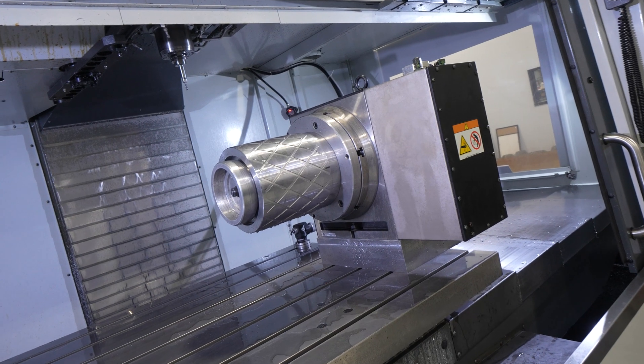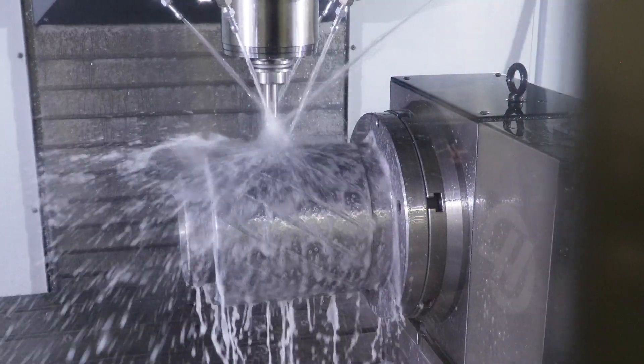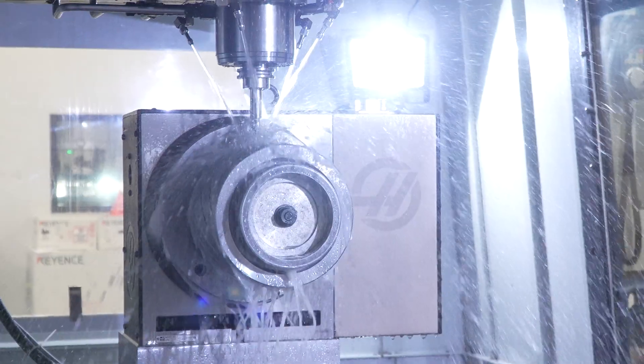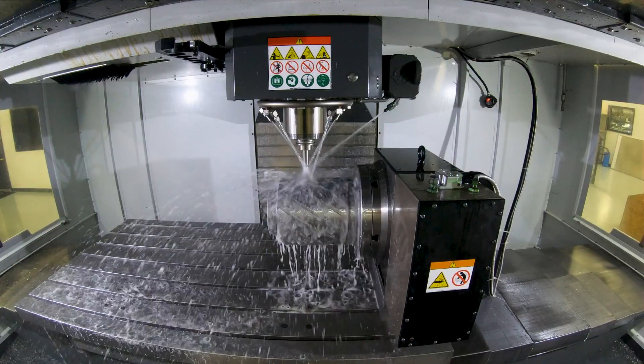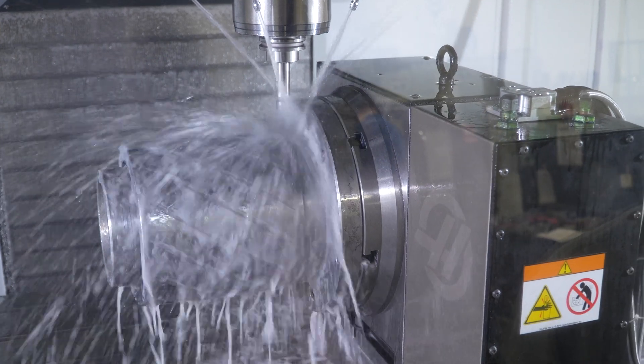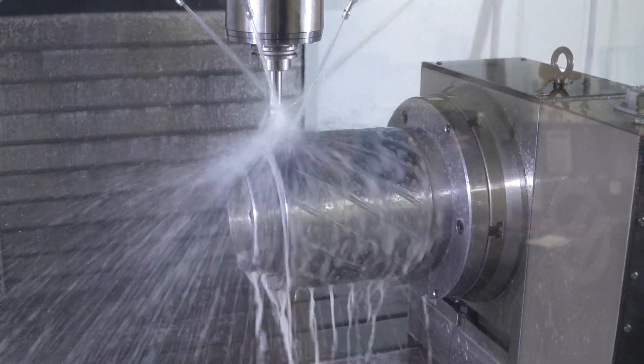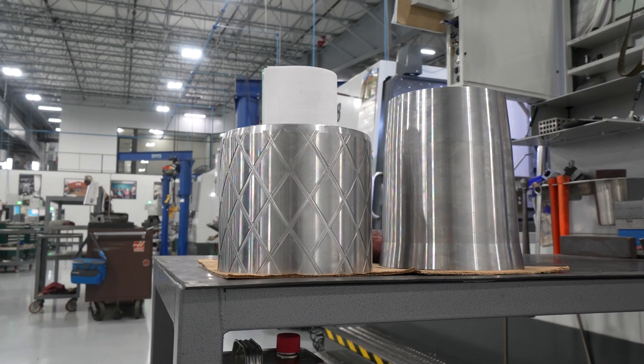On the VFA we're running a 300-pound part sitting on a rotary and cutting in three different axes at once, so you're getting a spline instead of a straight slot. What we're doing is basically making a clearance groove — like on an end mill — so that the diamond isn't wearing as badly.